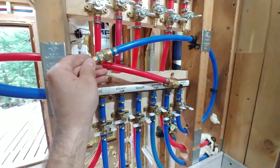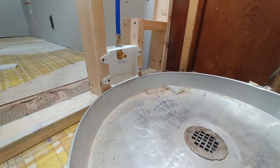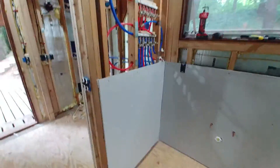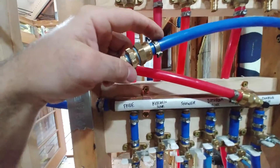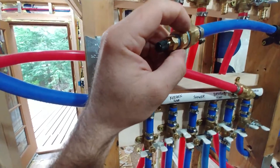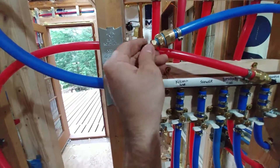For testing purposes we're not going to leave anything open - the stub-outs are solid and closed. That little route goes out to the petcock or spigot, which is closed. The refrigerator water supply valve in its fixture box is shut, and the laundry valves are shut as well. For the charge air fitting, we have a half-inch PEX to half-inch NPT female adapter, then a bushing that's half-inch NPT to quarter-inch NPT, and then a little Schrader valve stem - like the one you have on your tire - threaded in at quarter-inch NPT.